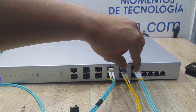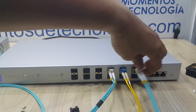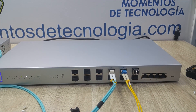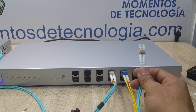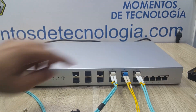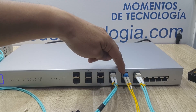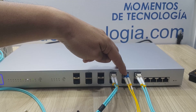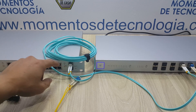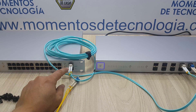Something very important at this moment is that these two ports are communicating with the same area of the remote network through different ports and switches. That is possible only because in my network I have specified that Spanning Tree Protocol is active — something we've discussed in other videos. This means I cannot simply remove any of these two cables, as each one is acting as a backup of the other, providing failsafe operation of my network. That is exactly how you can take advantage of those two additional ports that most modern switches have.